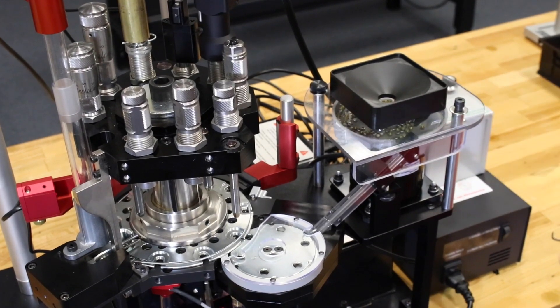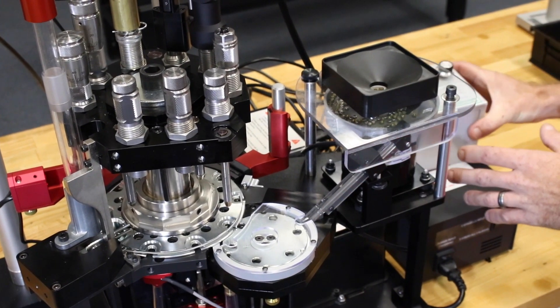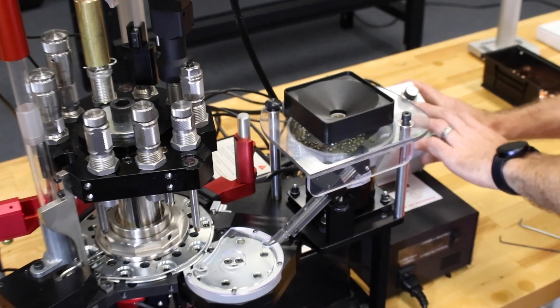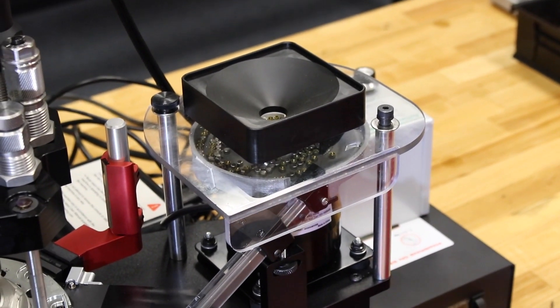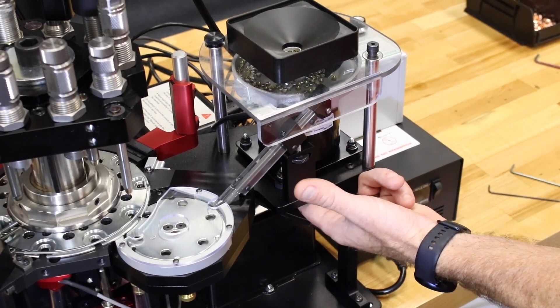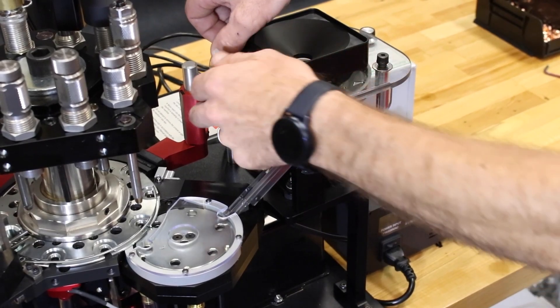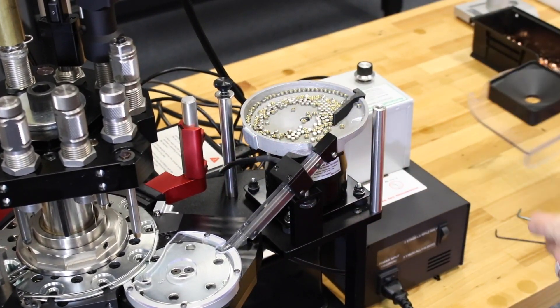In this segment I'd like to go over the priming system. I'll start on this side with the control assembly. You'll notice a dial from 0 to 10 — this is our frequency or speed. The secondary adjustment of the agitation or hard shaking is underneath the motor itself, accessed with a 3/16 Allen. I'm going to remove this cover so everyone can get a good view and go over some of the other adjustments we can make.